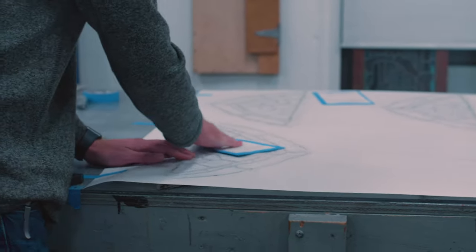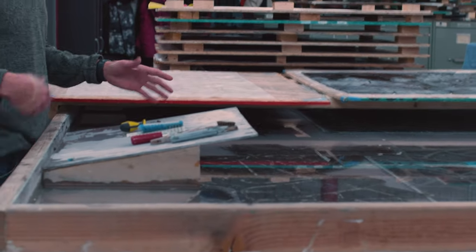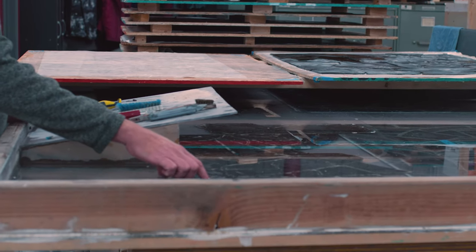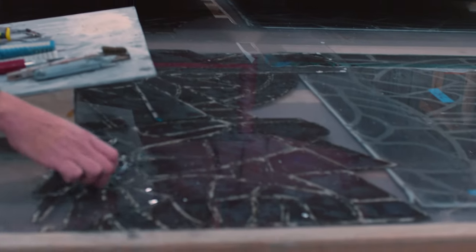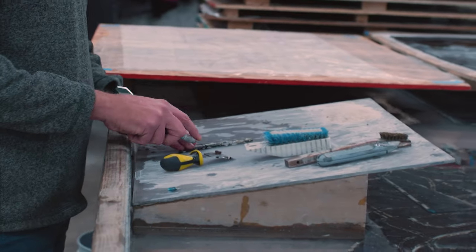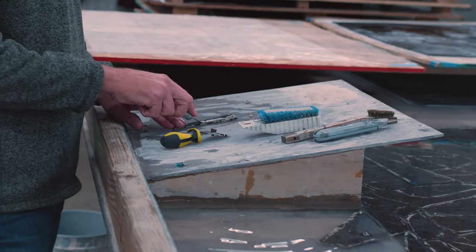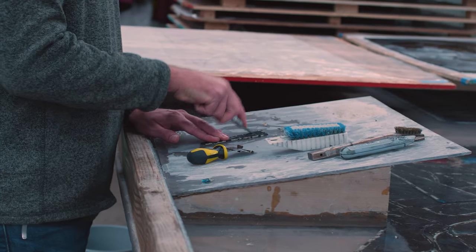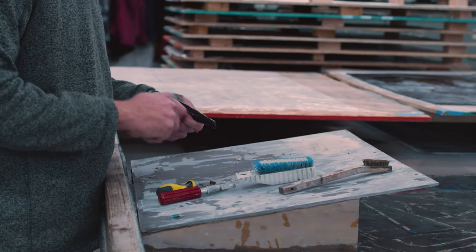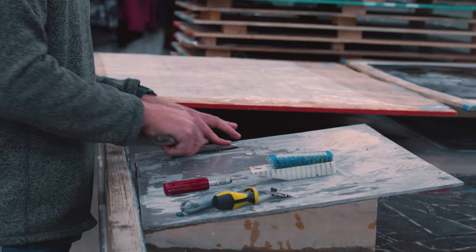You kind of have to get in and peel the individual pieces. We take the pieces of glass apart and separate the lead from the glass. Once we have the individual pieces of glass laid out, we'll take and clean them individually. We start by scraping off the old material with various tools and scrapers, and we test to make sure we can get all the old putty off. We'll go through the edges, brush them, and let them go out.